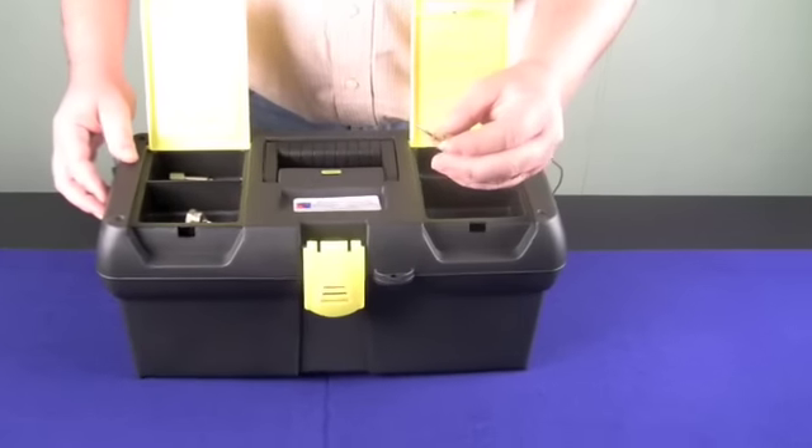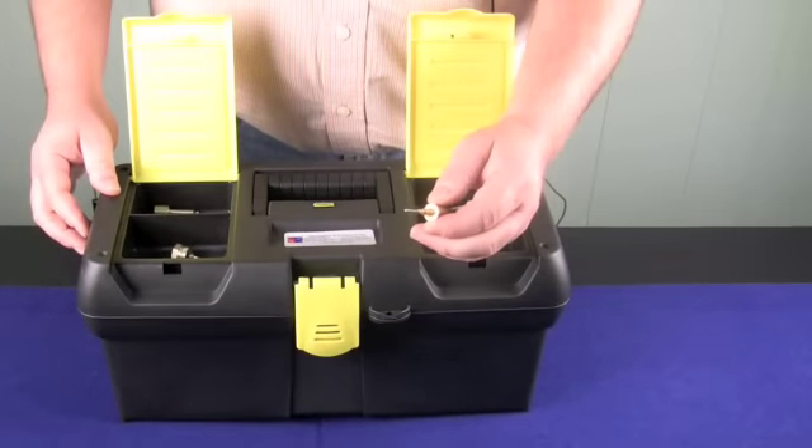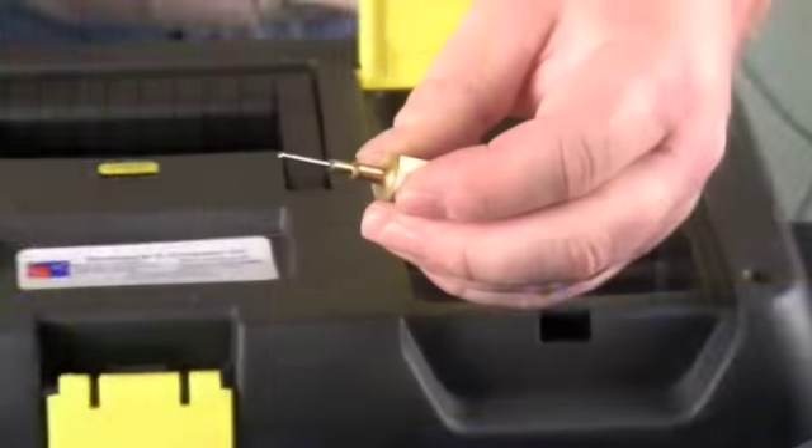The first item we have is for the calibration of the Honeywell pneumatic stat. The calibration needle is similar to the Honeywell, but the air ports come out the tip instead of the sides. And these are for the small Barber-Colman.